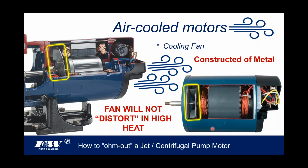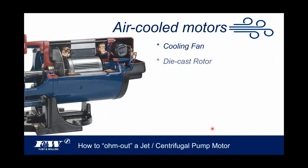Here's the problem with plastic motor fans: when you get into high heat situations, as you and I know, plastic is a material that can begin to soften up and distort. And of course, if that happens, you're going to kick out on thermal overload. You're going to overheat every time because you're not efficiently able to cool that motor.